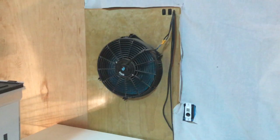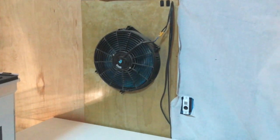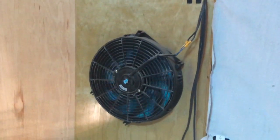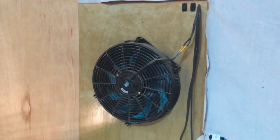This is my first attempt at an online instructional video, so please bear with me. The unit does not have its own reservoir built in, as it's installed into the wall of my yurt. Looking down here we can see a Rubbermaid bin full of water — the pump is running, and the water supply return prevents the unit from overflowing. This keeps my 30-foot yurt about 15 degrees cooler inside than outside when the air is dry.